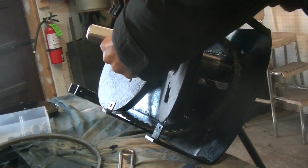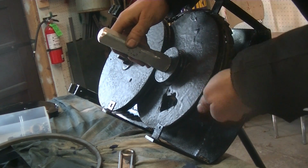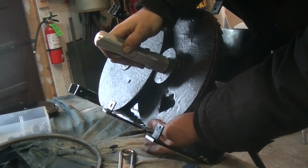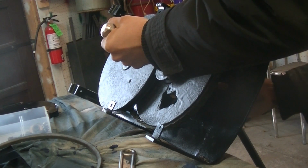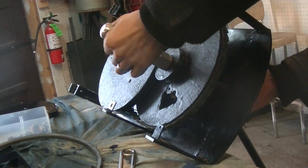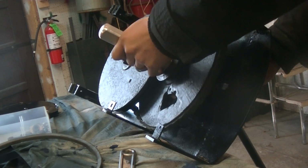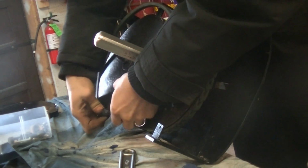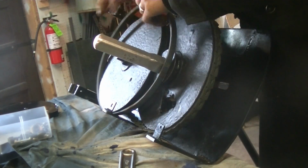Now we're going to pass this underneath this pulley like that into the belt. We're going to put the belt around the big pulley, and then take the hand wheel, tighten it on the back, and this is how we're going to tighten and hold all the belts up. Let's get the other belt here, put that around this top pulley, loosen that, move things around.